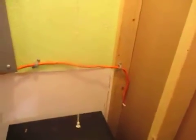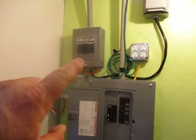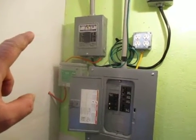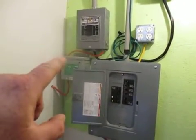So this is the other power room, which is going to be my off-grid setup. And in here, up here is a 50 amp plug that's for supplying this panel right here. This is where the generator transfer switch goes into, this panel. And on this panel I have two breakers. One breaker goes to the plug outside, it's 30 ampere, and then the other one is a larger one that goes up here to a 50 amp plug that I have up here.